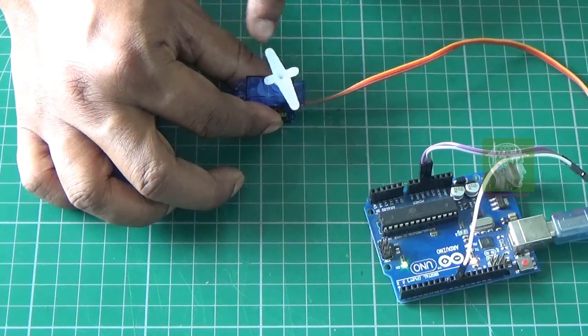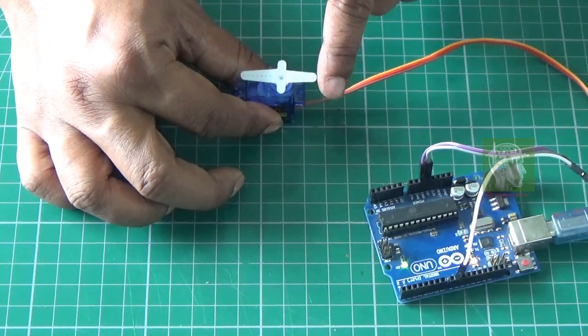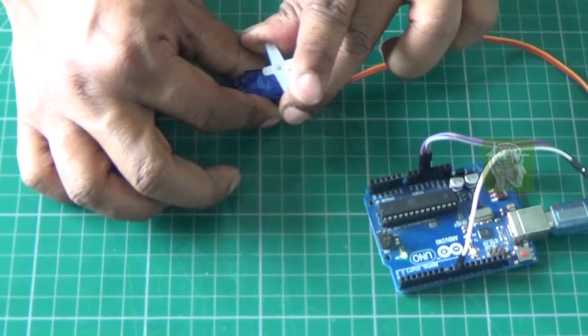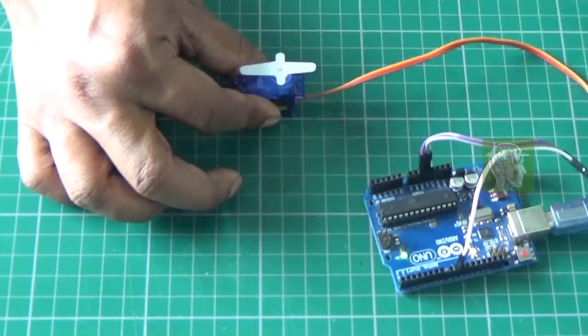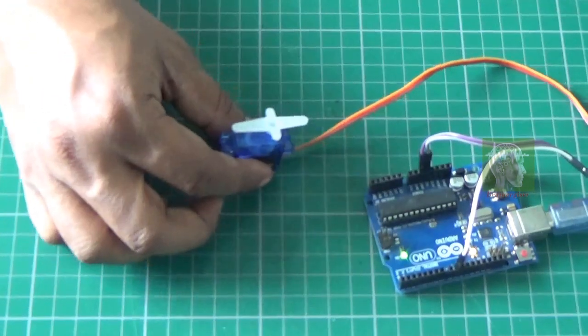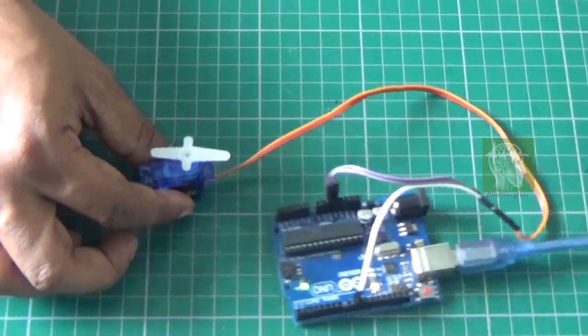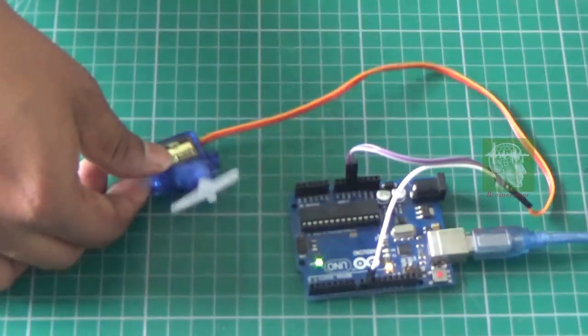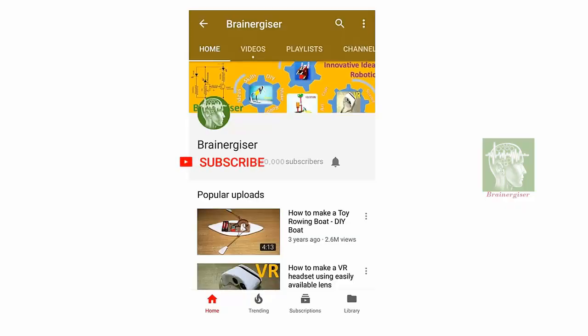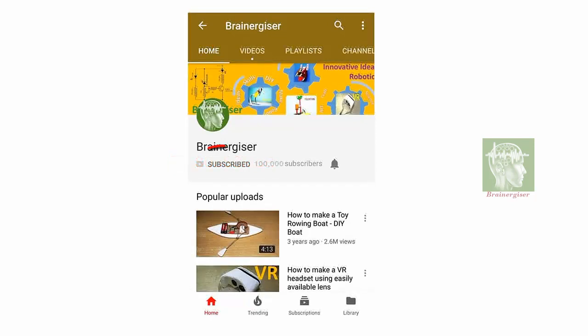You can fit the shaft wherever you want it to be, and change it according to your mechanical design. The beauty of the servo is that even if you prevent it from rotating, once the obstruction is removed it will return to the commanded angle — giving precise, repeatable physical movement. That's why it's so important in robotics. In the next video I'll show how to control it in closed-loop mode, which is also very important in robotics, and then we'll do some projects with servo motors.